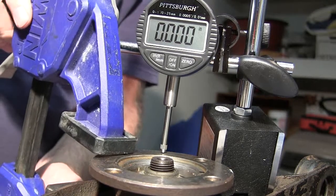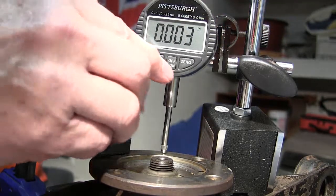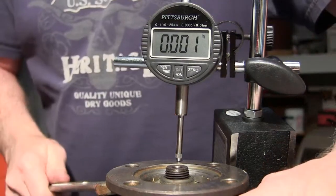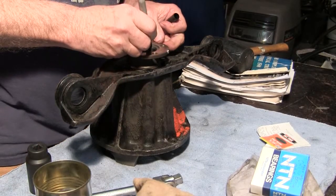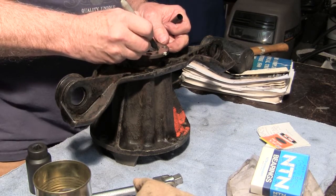Pull her down and lower this. I'm going to zero it and then see if it moves up .001 inches. I am marking the nut right at the corner and this flange.